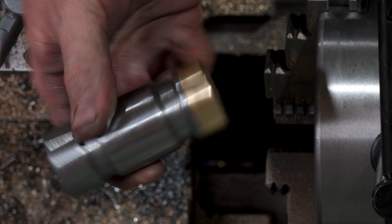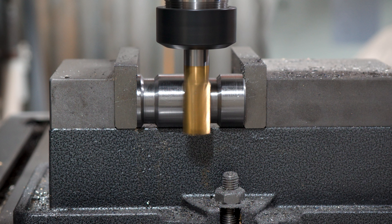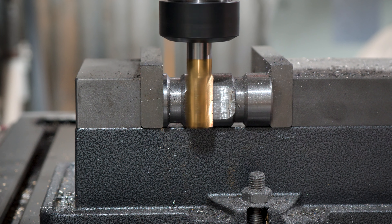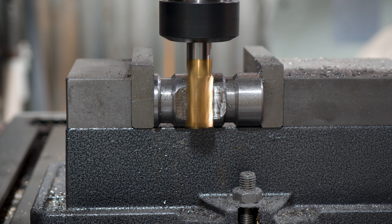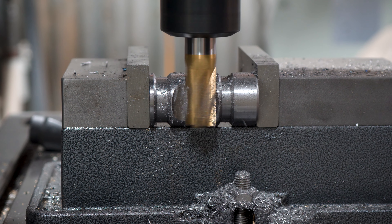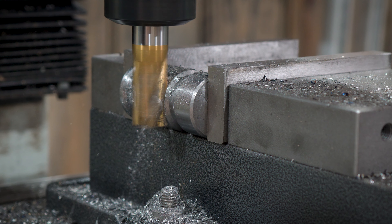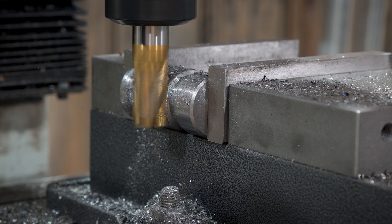It's looking pretty slick and would probably make a pretty acceptable hammer the way it is, but I do want to try some new stuff. This is the part of every project when things that seem pretty straightforward in my head start to get hard. I want to mill the sides to be flat along the face with a little curve up towards the cheeks. After playing around with setups for a while, this held the part the most parallel. I spent a good portion of time researching carbide inserts for the lathe, but I'm not sure if the colour of these end mills got me confused — they're high-speed steel and I ran this one flat out and cooked it. With everything slowed down, the side relief cut actually went pretty well.